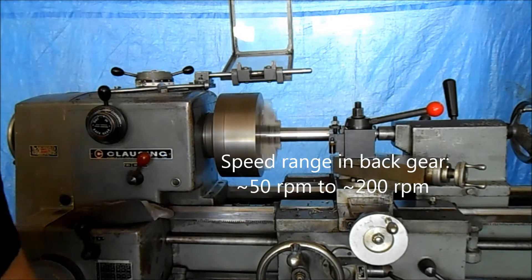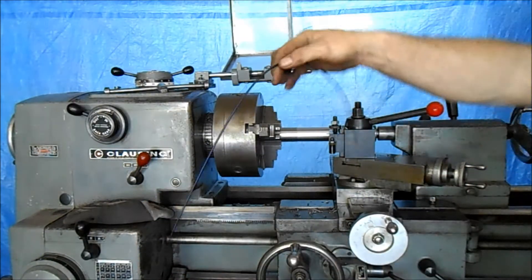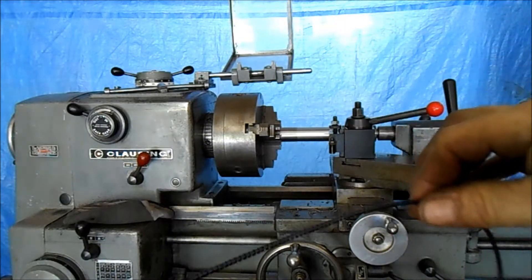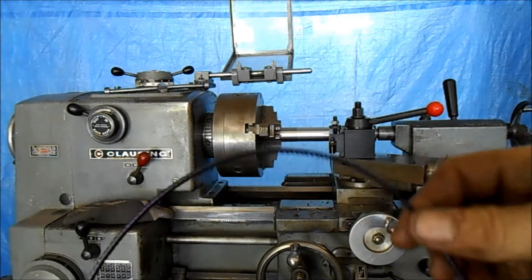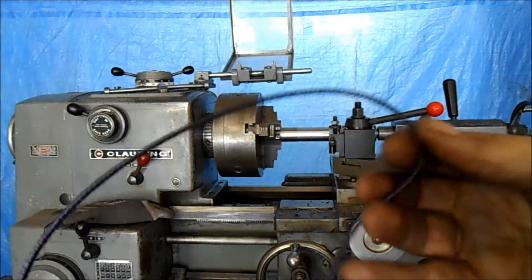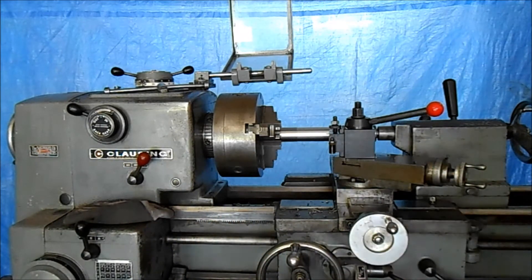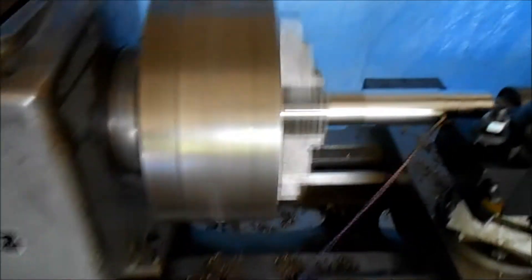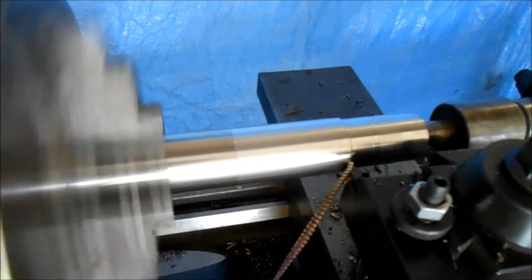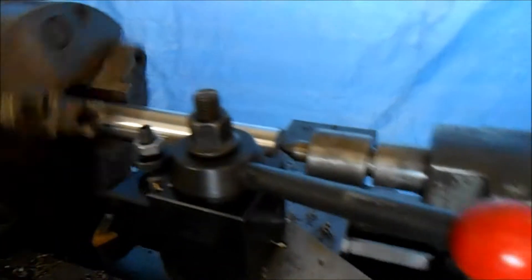We're going to take it out of gear now. Pretty phenomenal — we're getting chips like this. It's like a perfect chip. It's blue, which is nice because we're using carbide. It's beefy because we're taking a pretty hefty cut. And it's very uniform, which indicates to me that all the feeds and everything are working well and there's not a lot of play in the cross slide. There's the chip forming right there, just rolling right off. Comes out silver, turns blue. Here we can see how much material we're taking off and what kind of surface finish we're getting. The surface finish is actually phenomenal. It's in great shape.